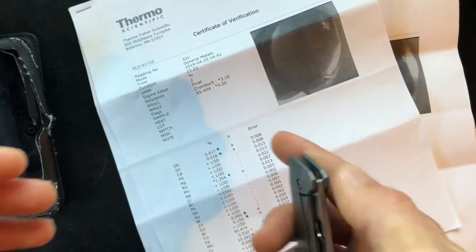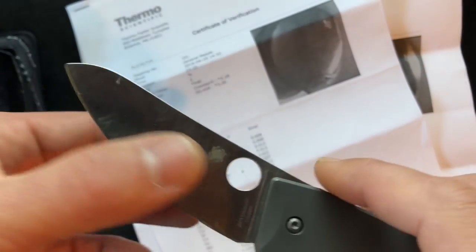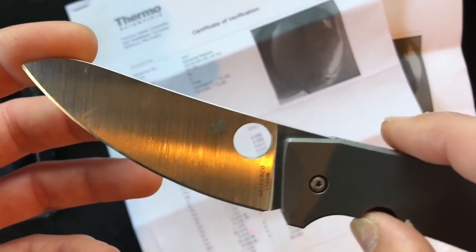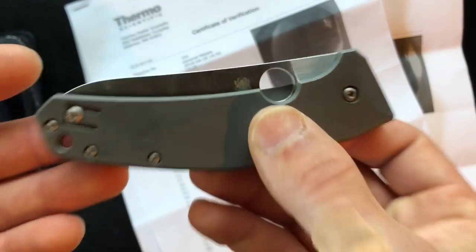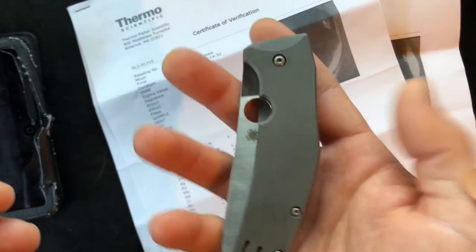It's good that the two readings are very close together — not a far spread. With these nitrogen steels, there's a much tighter formation in the nitrides, so the grain structure is very fine. That's why we can see high performance at such a low HRC. I would love to see this at 59 or 60, but it's sufficiently done by Spyderco — definitely not above and beyond, but that seems to be the going HRC on LC200N and other nitrogen-based steels.